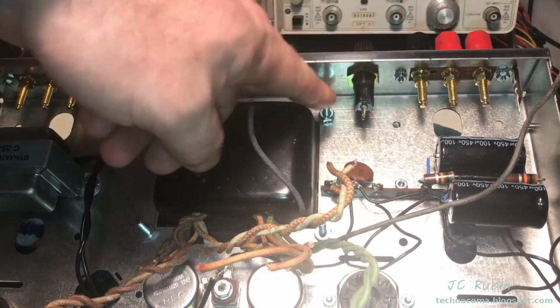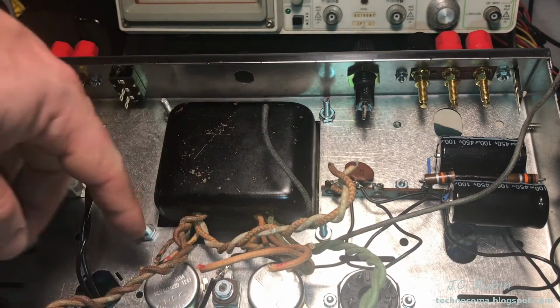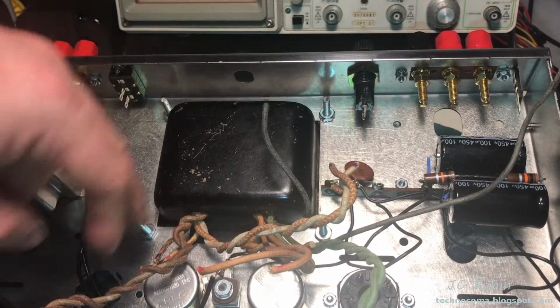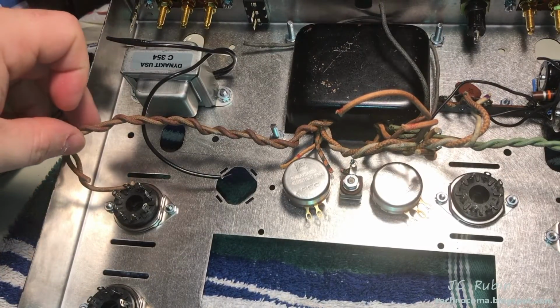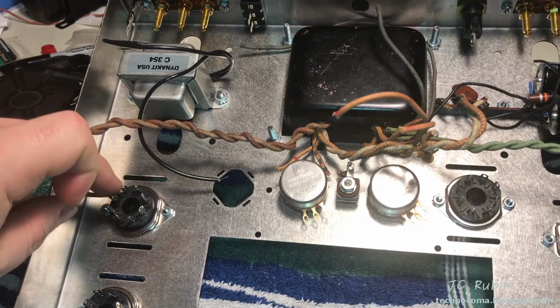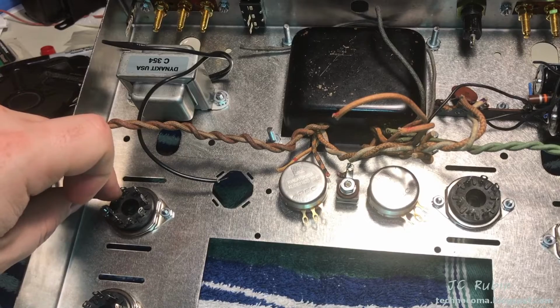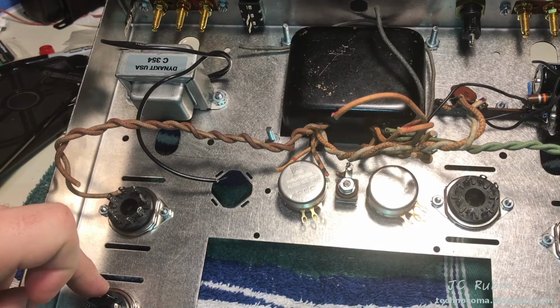I put the permanent lock style on the back. I got the temporaries on the front, and so it will remain until all the wiring is done. I'm going to start wiring in the power transformer. I'll be starting with the filament voltages here on 2 and 7 of the EL34s. I'm going to be using the bottom holes for these so that I could later wire in the pigtails that'll move onward to the other sockets and off to other locations.